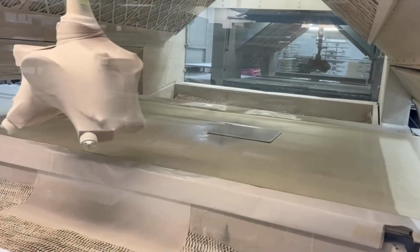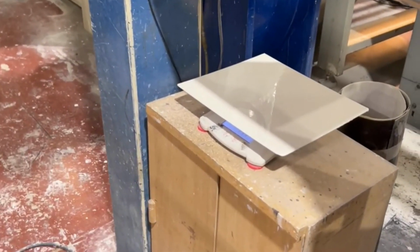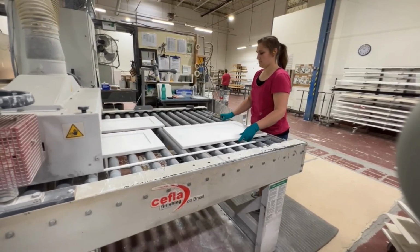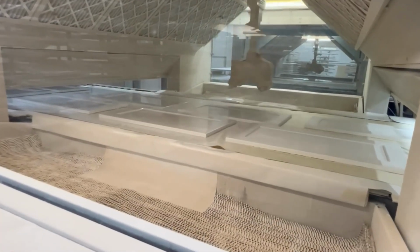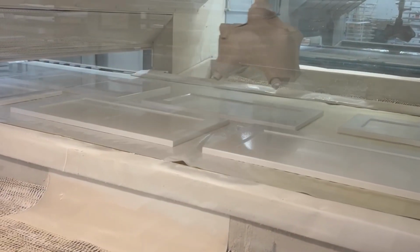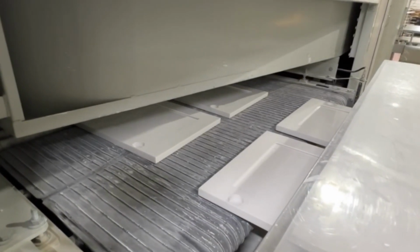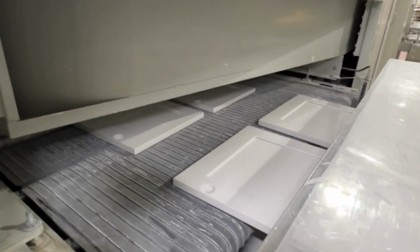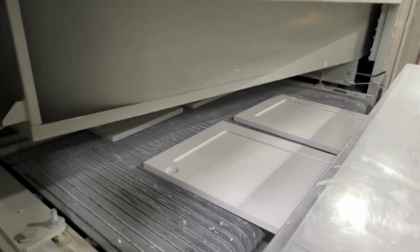When applying a machine-sprayed solid lacquer color, a test piece is first sprayed to ensure the correct amount of lacquer is being applied. After setup and adjustments are made, your wood products are sent through the robotic spray tunnel for their painted top coat. From there, the painted products are sent through the drying oven, which helps the lacquer finish cure smoothly and evenly while preventing airborne particles from contaminating the finish.